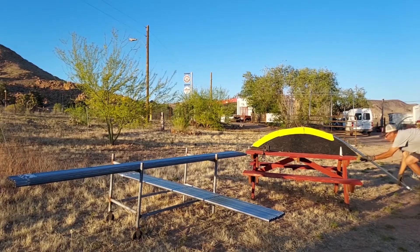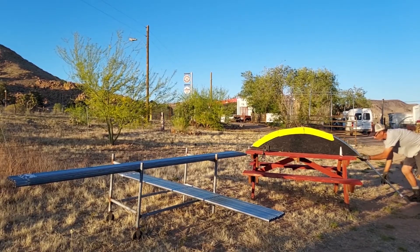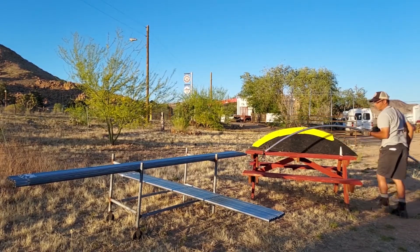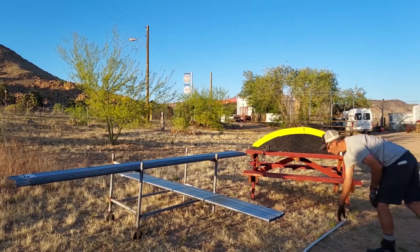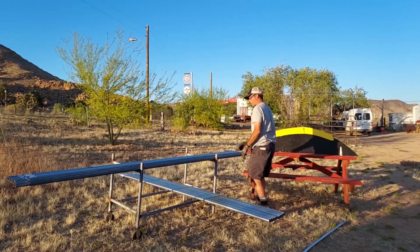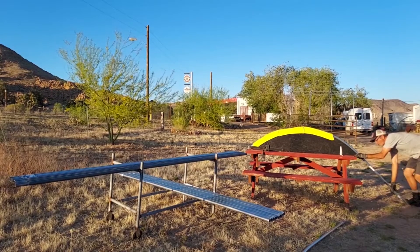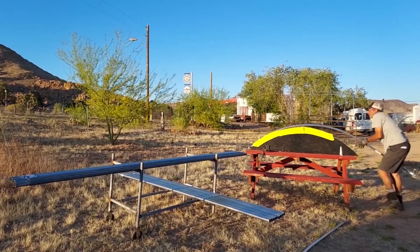I have the tubing set up on this rack so it's organized and I know which halves I need to bend. I'm bending the wide end first, so the narrow end of the tubing is at the top. This tubing is what they call top rail tubing — it's 1 and 3/8 inch in diameter, usually 17 gauge, and you can get it at your local home supply store. It's in the chain link section, usually outside by the nurseries, out by the garden.